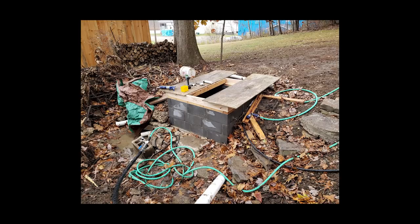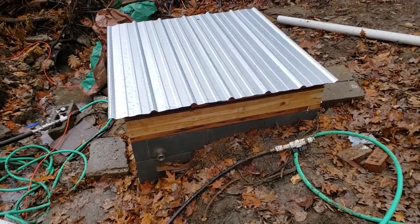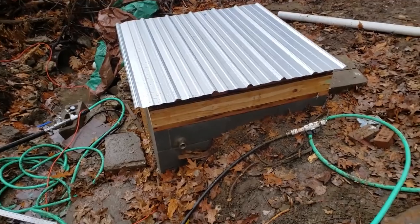This is the only image I have of construction — I didn't record any video because it was raining pretty much the entire time I was building this. You can see I have a perimeter of two-by-fours with a foam moisture barrier between them and the block, all screwed down with concrete screws. I built a two-by-six frame above that with a slope from right to left so that water can drain off, then half-inch plywood on top glued and screwed down, which supports the tin sheeting.